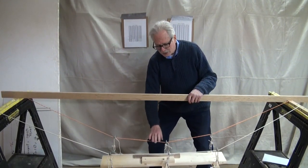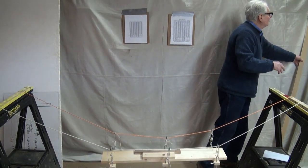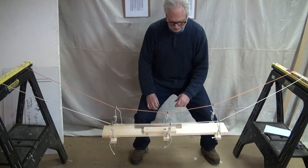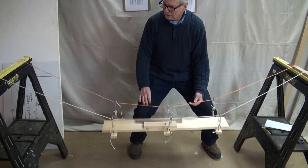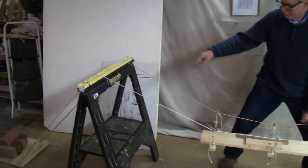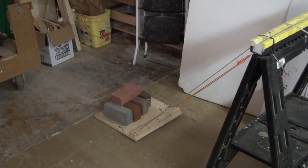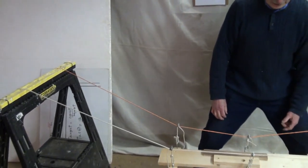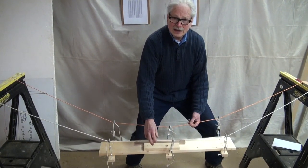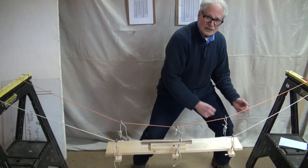You're going to have more trouble just getting all the suspenders and the deck level, but that's for another video. So we've got a live and a dead load of 6 pounds. If we had a heavier load, let's assume that the anchorages are not going to move — you've got enough weight on them. If you've got enough weight on the anchorage, it won't move. But what could happen if you have a thinner main cable instead of this 3/16 inch rope — if you have something thinner, it could break. So we've got to figure out how to compute how much tension or how much pull is in the main cable.